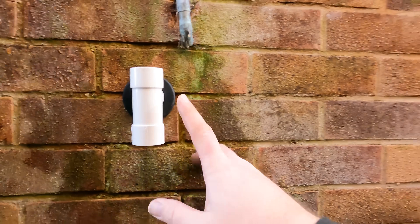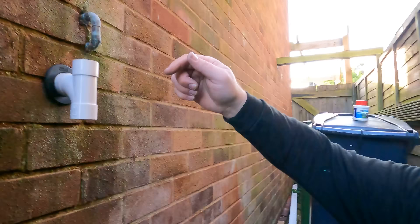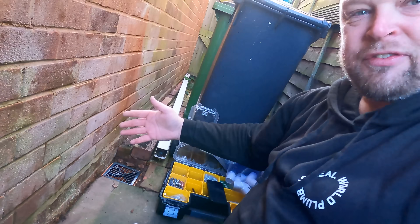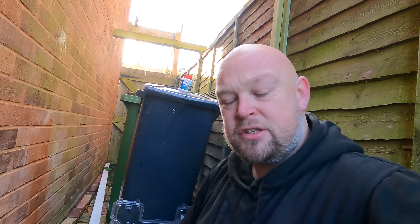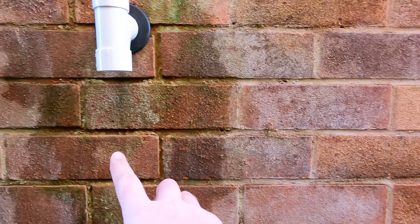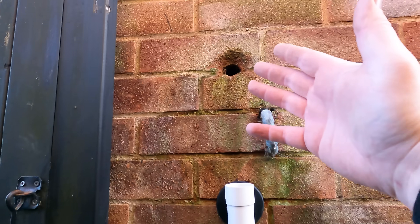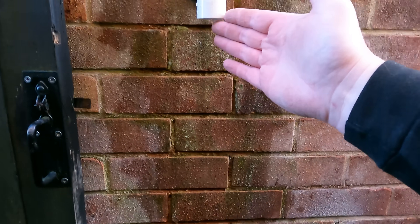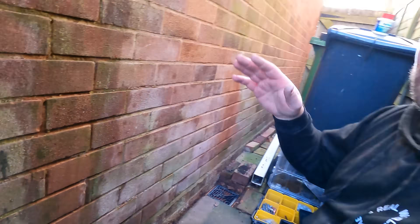I've come out of the pipework now with a tee — the reason being is the trace pipework goes in the top, and it comes supplied with a little bung that goes inside the top. The tracer feed will run down there and across internally inside the pipe. If there's any left over at the end we can wrap it externally around the pipe — it's all going to be insulated anyway with black external insulation. You can see where the condensate water was running down the brickwork; it's not great but we're sorting that out by running our pipework down and across into the gully.